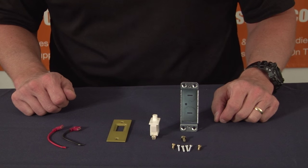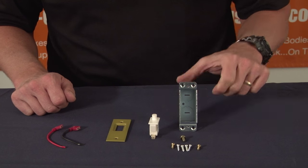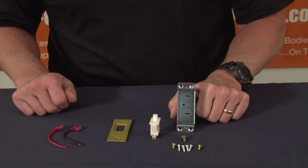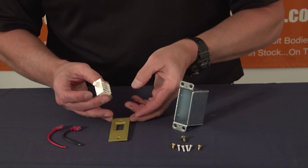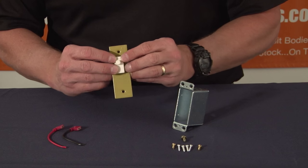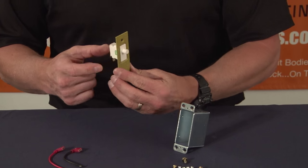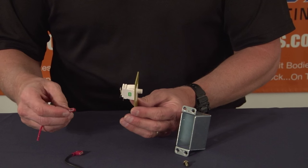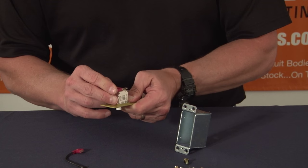as well as installation hardware. In order to install this box, you simply pull your conductor through the door jamb, take your switch, slide it inside the plate, and it snaps into place, like so. Now that your switch is installed, you have to attach the wire leads by snapping them on, quick and easy, to make your electrical connection.